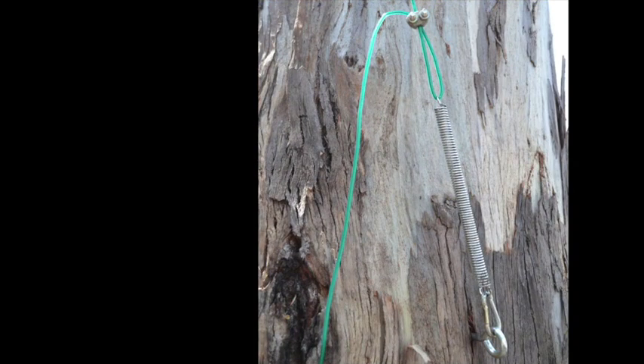So here's my solution. It's taken a fair bit of punishment over the recent months, but it's still up high where I put it. Here's how it looks as a unit: there's an eye bolt screwed into the tree, connected to a spring via a carabiner. And the other end of the spring goes directly to the guy wire, and it's tied off with a swaging style clamp.